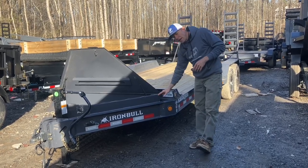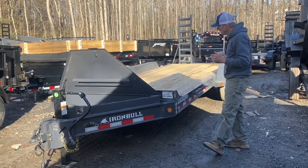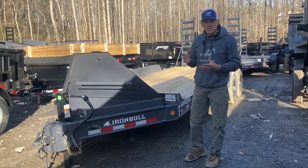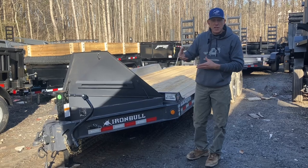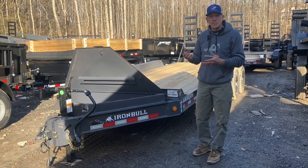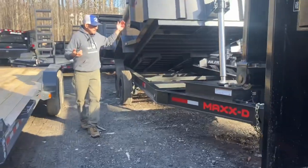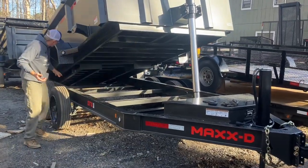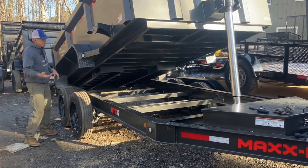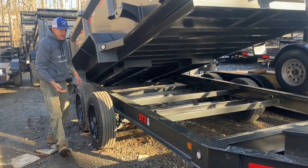What I love about the eight-inch I-beam construction trailers is you have the same rigidity from tip to tail. The old style of doing it used a six-inch channel — a double six-inch channel at the front at the tongue, going to a single six-inch channel at the rear. You can see here it's the same construction, with the I-beam style running from front to back. If it had a double six, it would run to a point and then go single six-inch to the back.